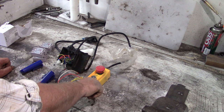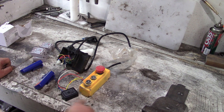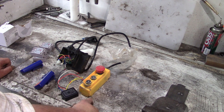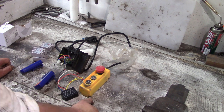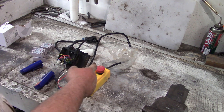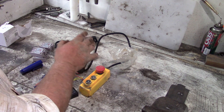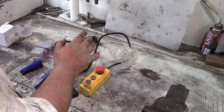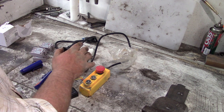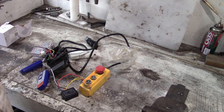I don't know if I'll even need 4, to be honest. I'm not 100% with AC. I've spent my whole life working on low volt DC, like professionally. Well, you get paid for it anyway. I know enough that when I see a capacitor, you've always got to short the thing out. Rather than knowing every single instance and whether or not that capacitor is going to discharge, where it is in the circuit with the power off, I always put something across them, just because, like I say, I'm not an AC man.